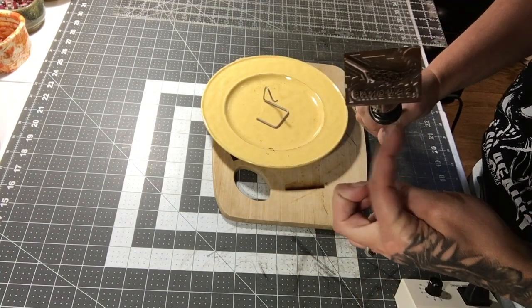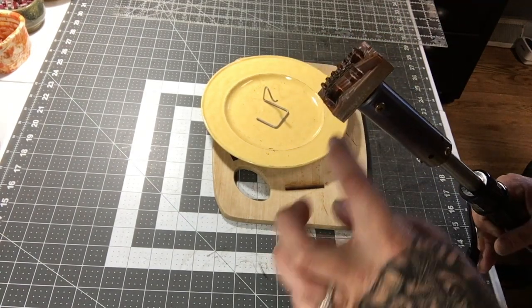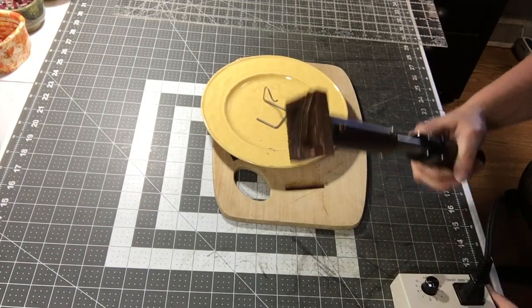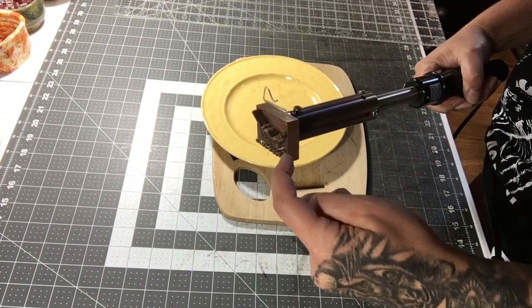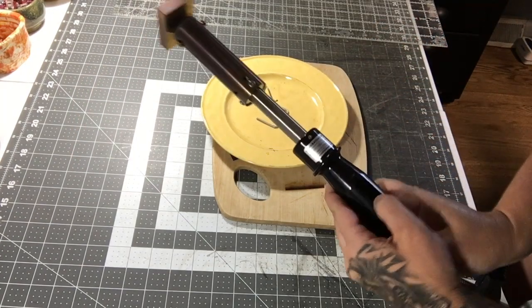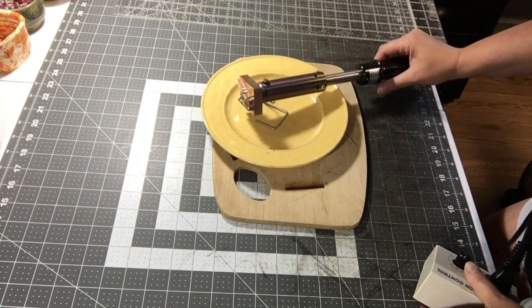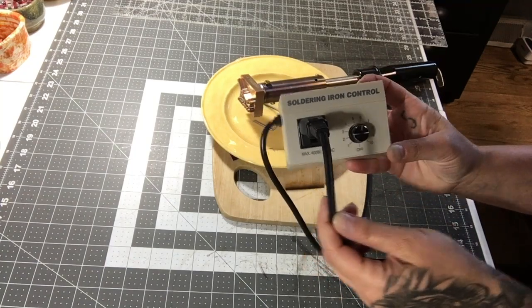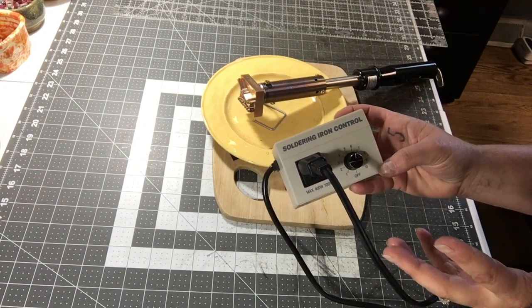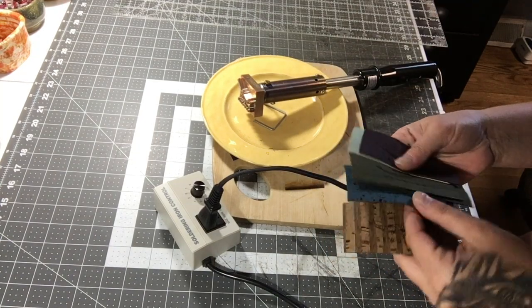The iron head is roughly 2.25 inches wide along the bottom by one and a half inches tall, and about a half an inch deep. The actual brand — the cutting of my logo — goes in about a half an inch. The head is removable; you can twist it off and swap it with another plate. It has an on/off switch and makes a buzzing noise when on. The temperature control box I have set at just under six, and I've been tweaking it depending on the color of the cork.